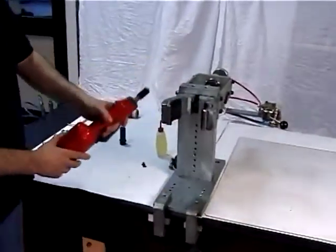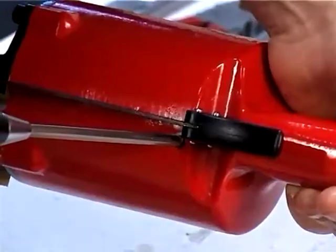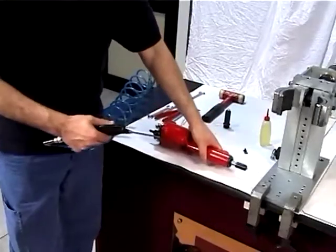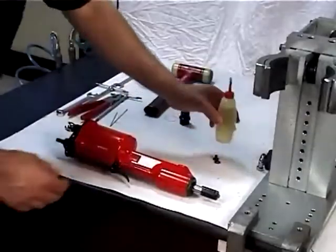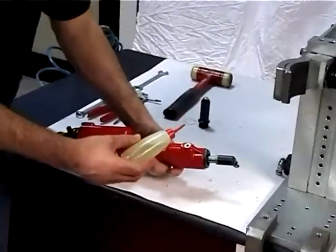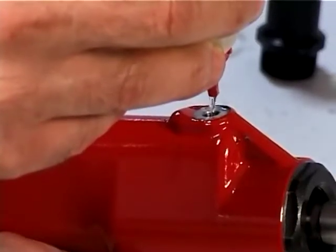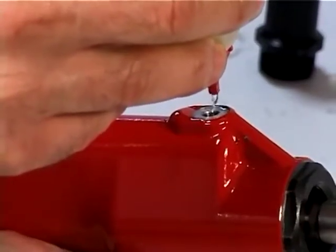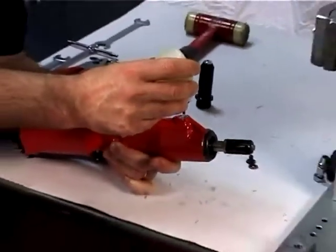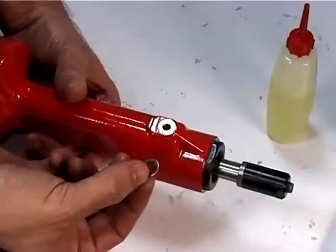With the riveting tool positioned horizontally, not fed, make the piston go back completely by means of a short jet of compressed air through the hole situated on the tool body. Fill up the reservoir with oil, viscosity index 32 degrees. Perform this operation slowly so as to allow the air to exit the reservoir. This operation is completed when the oil laps the threaded port.